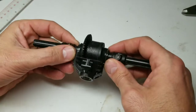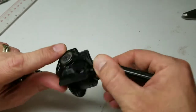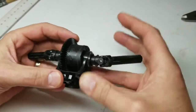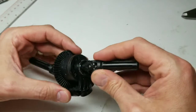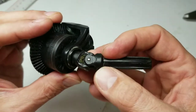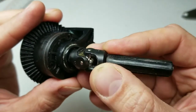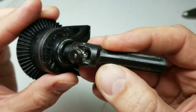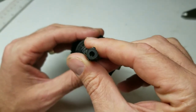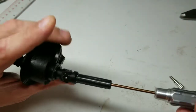Now for the diff itself — how do you get this yoke assembly apart? There are two screws, one up here and one on the other side, and you can take those out, but you still can't get it apart without taking the drive shafts apart. That's where it gets interesting. If you hold this up to the camera you can see down in there there is a hex screw — but how do you get to it? That cross pin has a hole in it, and I can take my 2mm hex and run it all the way through there to grab that nut.